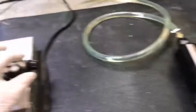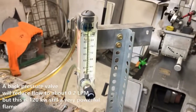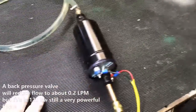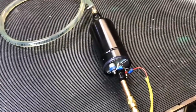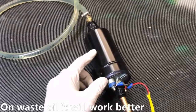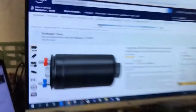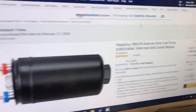So that's just way too high. If I turn this thing down to the very lowest setting, it just drops off completely and stops pumping. So it's a little large for very low flows. But a bypass valve could definitely solve that problem. One of the reasons why I went with this particular pump is because of durability. This is a $40 pump — I'll leave the link in the description for this particular unit with the specifications and all that.